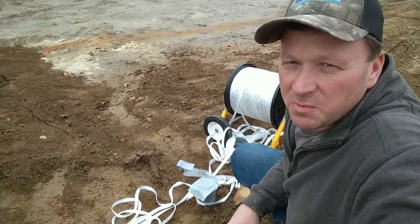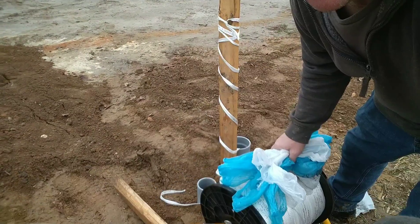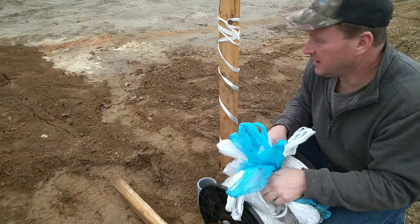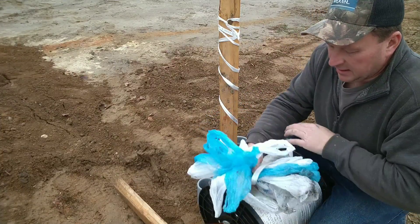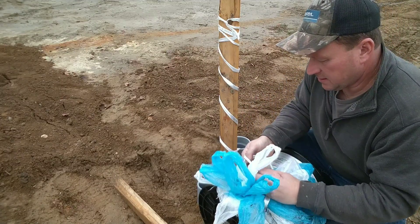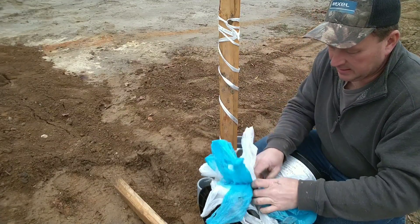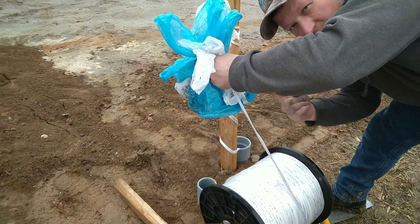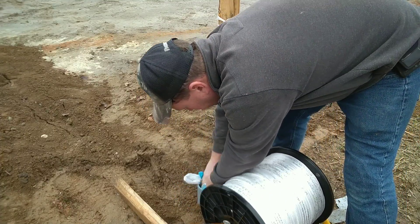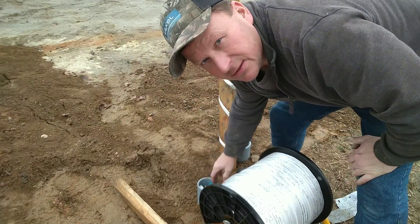I apologize about the wind. We're back at the spool — it looks like it over-spooled quite a bit. I've got a little mess to clean up, but we'll pull the secondary voltage in. We're going to use the same seven bags that I used to pull the 510-foot run. This run here is about 60 to 65 feet, doing the same exact thing. One thing I didn't elaborate on earlier: you want to make sure this is over-spooling on the top side — meaning it spools from the top down into the conduit. If it's too tight, you can always take a couple bags off to adjust your tension inside the pipe. Let's hook this up and see what she does.